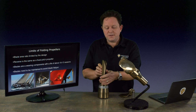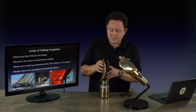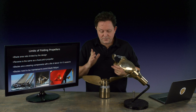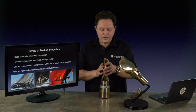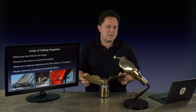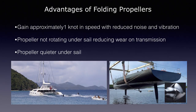Reverse is one of the limits always talked about. If it's managed very well with the designs and you've got the right expectations and understand the boat, it's never an issue. The other thing most people don't realise is that folding propellers all have teeth, and those teeth mesh together and wear. You'll have fixed-pitch propellers that last 20, 30, 40 years if looked after, but folding propellers, because the teeth are wearing all the time, you're probably going to get about 10 to 12 seasons — then the teeth need to be looked at or fresh blades fitted. It is a wearing part, and that's why it's so important to keep it maintained every year, keep the buffer pads in, and look after it well.